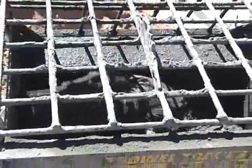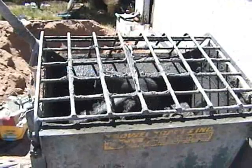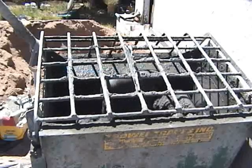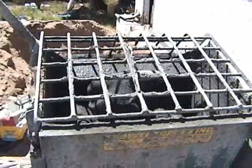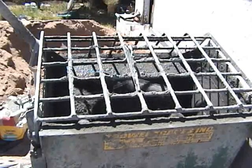Now you can see the consistency is looking kind of granular, but it's flowing very well, which indicates most of the cement has mixed and reacted — it just needs a little bit more time to get a little bit creamier. Still haven't added that water. It looks like just waiting paid off there. Since most of the nodules of dry cement are going away, this would be a good time to go ahead and add the Micron 3.